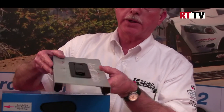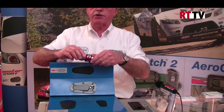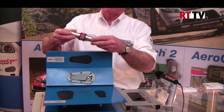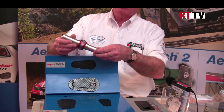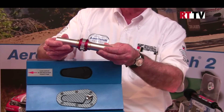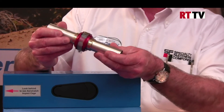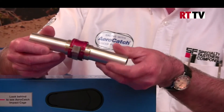This gives a very secure fixing and can either be top mounted on the panels shown here or from below, which gives a smaller envelope. Moving on from panel fastening, one of our recent products is the Hydroflow flexible fluid and oil coupling. This is a flexible coupling which gives you over 6mm of axial alignment and also plus or minus 4 degrees of radial alignment.